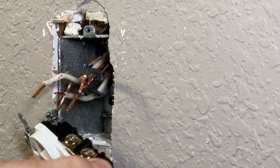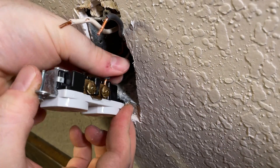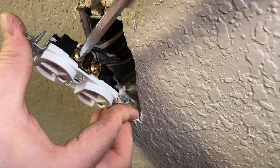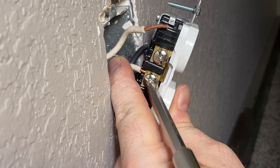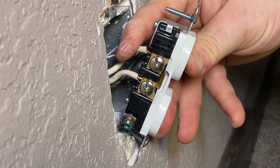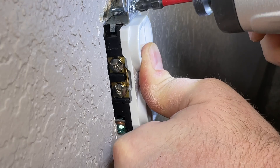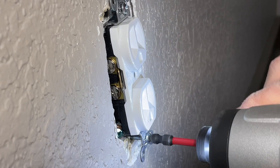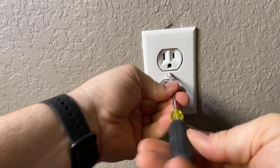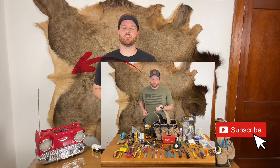A tip: start with the ground, and it's best to use a screwdriver so you can feel how tight you're getting your connections. Then you curl them down. Now put your outlet back on, and when you do, make sure the screw slots are up and down — that's one of my pet peeves. Now turn your power back on, and that's it. Now go out and build your skills and your confidence, and I'll see you in the next video.